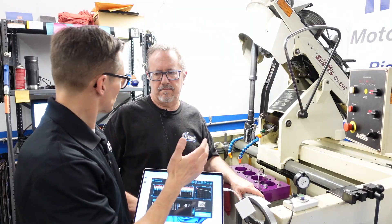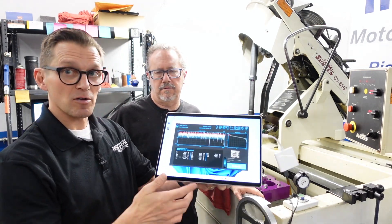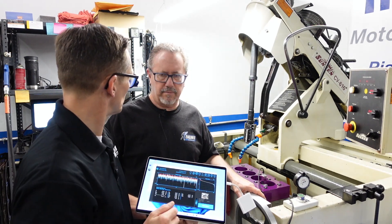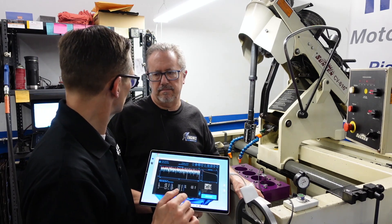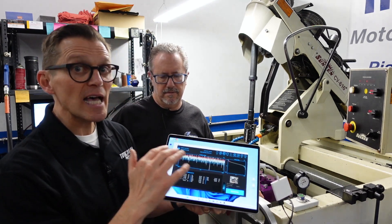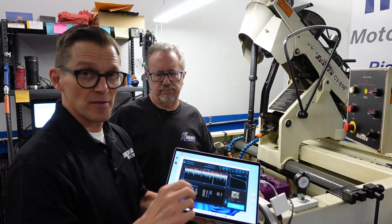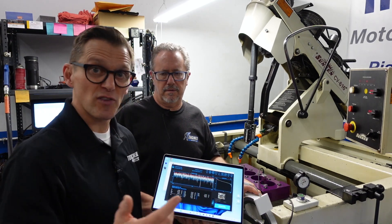After those last seven to eight seconds of plateauing, the surface is nearly there. The final operation is just a couple of brush strokes to take the peaks out. That's really all that's left to get the surface just right — take those peaks down, and that leaves the valleys and core roughness needed. Let's put the brushes in and finish it up.